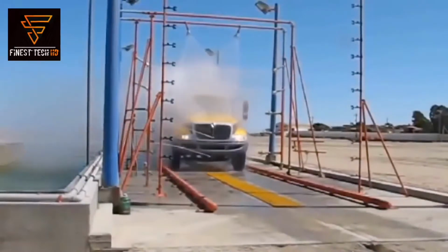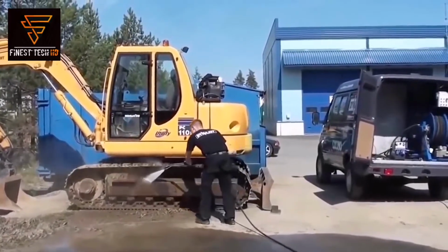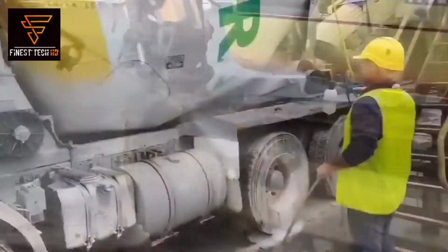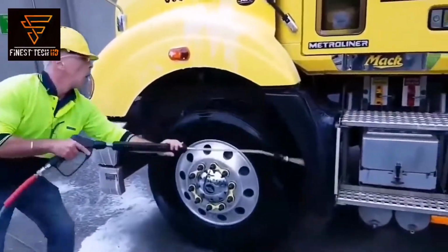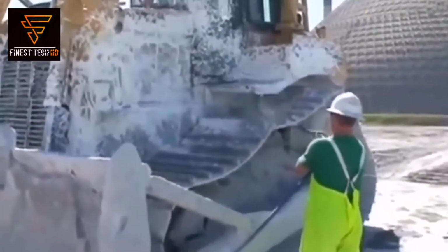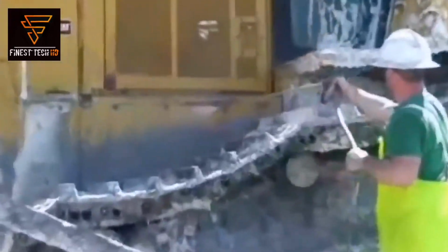Pressure washer nozzles alter the direction of flow and velocity of the water. Nozzles allow users to reach a greater distance or apply more pressure to a difficult-to-clean surface. However, they can be dangerous. Nozzles are color-coded for easy identification, with black nozzles covering the widest degree, 65 degrees, and red nozzles covering the least, 0 degrees. Great care should be taken when using a 0 degree nozzle as it can cause injury to the user and damage to surfaces.